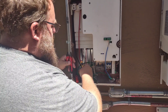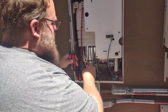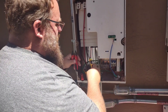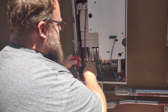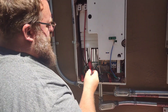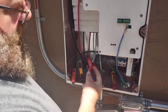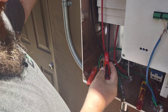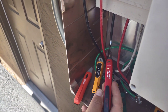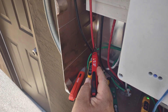Now I've got it set to the lowest range. I turn it off and back on. This is one that does a neat thing — it's showing low voltage as I get close, and as we get up close it automatically switches over. What I really like about the Milwaukee version is it automatically switches. As we get close to the voltage it blinks orange or yellow, indicating 10 to 49 volts, and as we get closer it switches over to full detection. Getting up close, it's telling me there's juice in the area I need to worry about — not right against the wire, but somewhere in this box there are live wires.